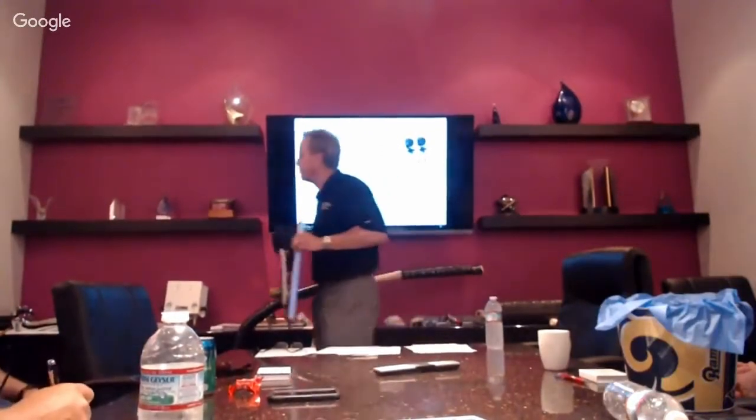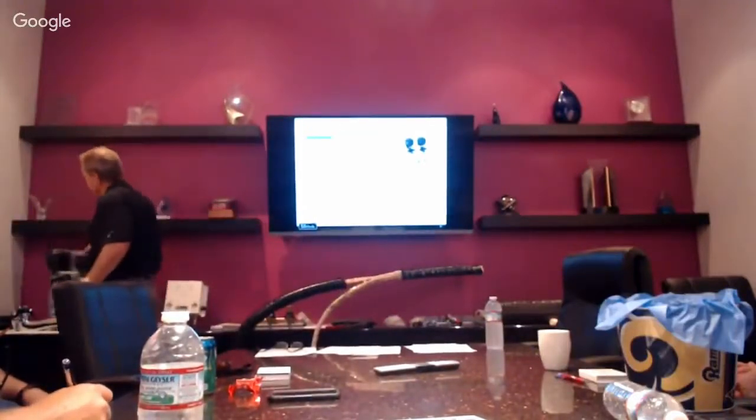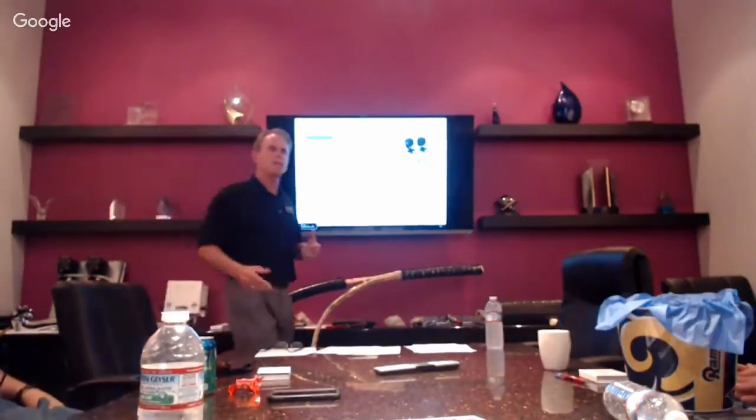So sometimes you get some of these little craft beers, and they will have different types of CO2 content. And when you get something that's like 8, I don't even know what the measurement is. It's blocks of CO2. It's done with 8 psi. Volumes, yeah. Yeah, volume, 8 volume. It pushes differently than something at 13 or 14. So you can't have those hooked on the same pressure source. It doesn't happen very often, but it happens occasionally.